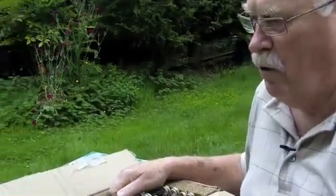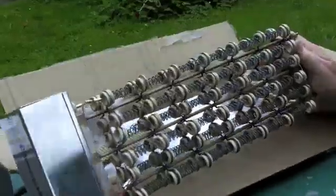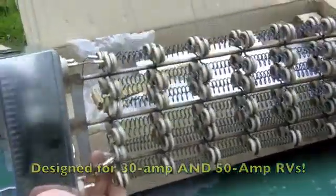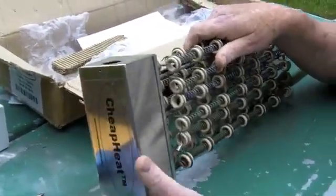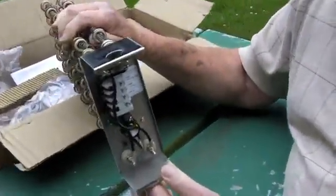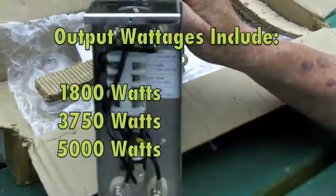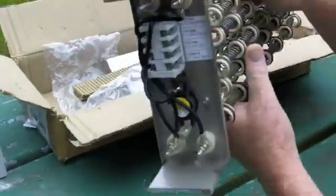The next thing we need to discuss is the heater coil. This is the heater coil we're talking about. You've got one heater coil that operates at three different heater settings and two different voltages — it's all one unit. This is a patented coil and we are the only ones that have this. It makes it so easy for the technician to hook up: all the technician has to do is slide in a wire, twist the screw, pick which heat range you want, slide in the other wire, twist the screw, put the cover back on, put two screws in it, and he's done.